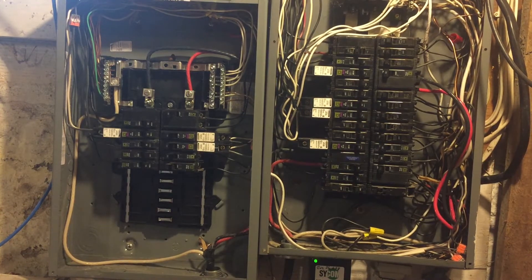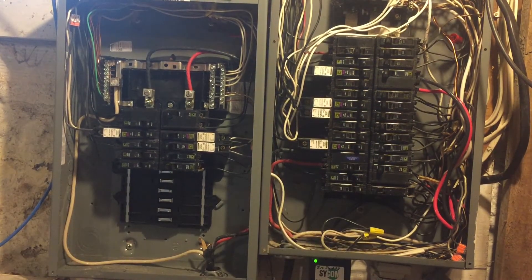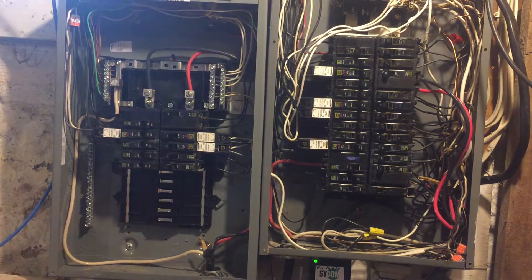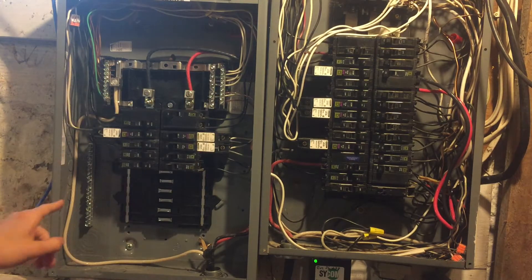I want to always remember: if you're going to do this sort of electrical work, turn off the electrical panel. So, I've gone and installed my ground bus bar, and it's in there tight — not going anywhere. Now what's left, which is the main job, is to do the tedious work of moving all these grounds and a few of the grounds over here to that bus bar.